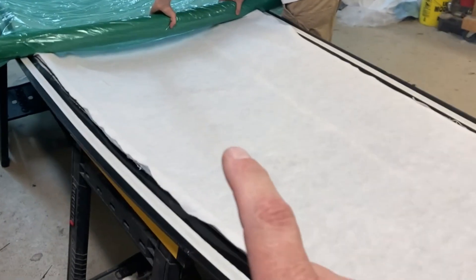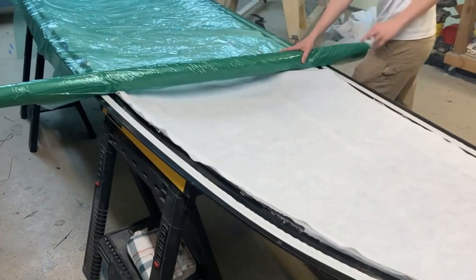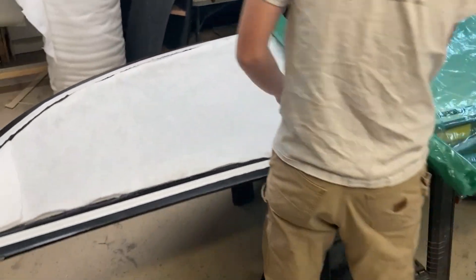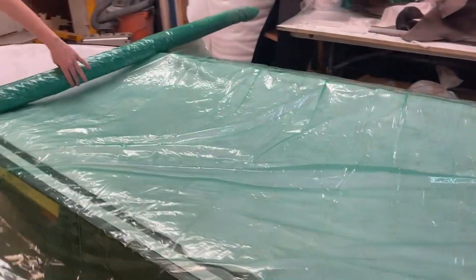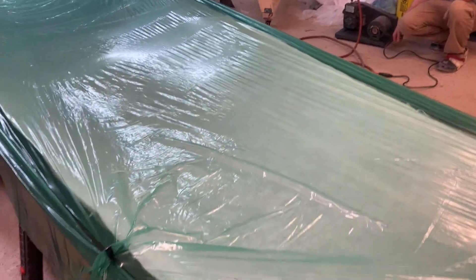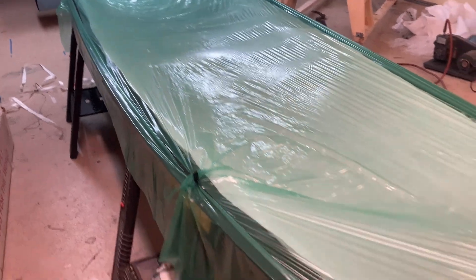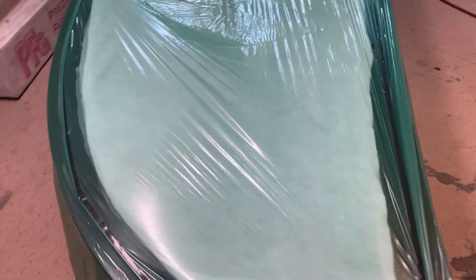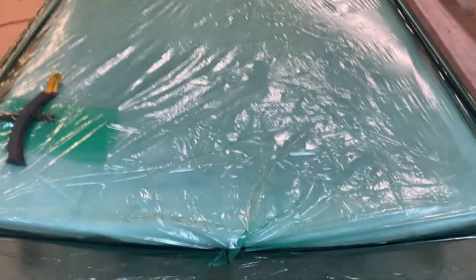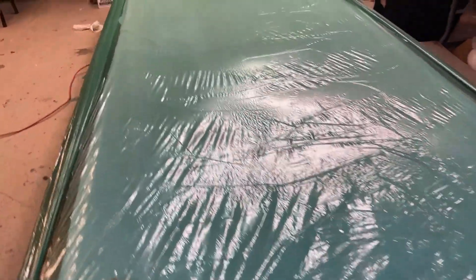Painter's plastic is down on top of the peel ply, and breather cloth is down on top of the plastic. Ryan's rolling out the vacuum bag — that's the final step. We're going to get that stuck down and get a vacuum drawn on it, make sure everything's pushed down nice and tight, and then let it cook overnight. Vacuum bag is all sealed down. This particular vacuum pump doesn't have a reservoir, so it takes a little while to evacuate. Normally you build up vacuum in a reservoir and when you hit the switch it's pretty quick, but this takes a couple of minutes.